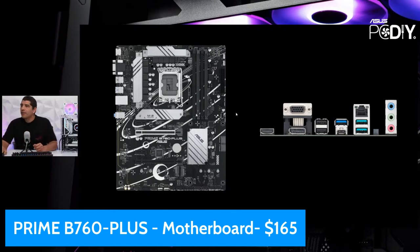You have USB-C connectivity, both legacy and the newer USB-C internal header, present on here. In terms of Wi-Fi, this board does not have Wi-Fi, but it does have a vertical CNVi Wi-Fi slot, so you can just add in your Wi-Fi module. You do have multiple M.2 SSD slots, 1, 2, and 3, so you can support up to 3. You have PCIe Gen 5 support, and then you have 1, 2, 3, 4, 5, 6 rear USB ports, including a 20 gigabit port, then 10 gigabit, I think, right here, and 5 gigabit. So it's actually quite robust.